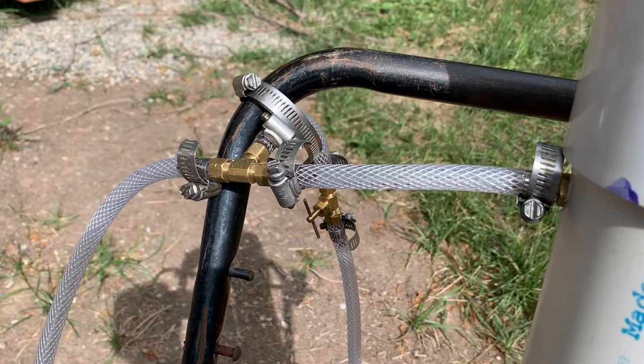I finally ponied up and bought Dome Gaia's Dragon XL foam generator, and that made multi-batch production feasible. Their machine works great, but one must still verify foam density with frequent checks between batches to ensure you don't get a bad batch. With my intern Duncan's assistance, I poured a six-inch layer of AirCrete onto the floor of our cottage as an insulating layer. I floated out the surface and troweled it smooth before adding row cover to the wet surface. My hope was that I would be able to tile directly onto the cured surface, but the AirCrete was of low compression strength.